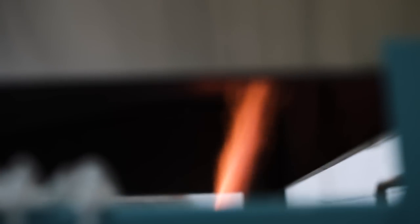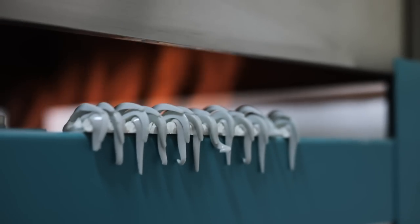Early the following morning, I'll ignite each of the four burners with the door swung open. This way gas can't accumulate inside the chamber and then be suddenly ignited, which, like you might guess, can cause explosions to occur. But once all four are lit, the door is tightly sealed and the temperature is gradually increased until approximately 1290 degrees Celsius, which is about 2354 degrees Fahrenheit.